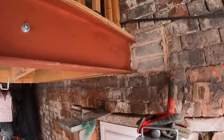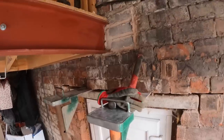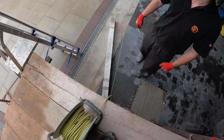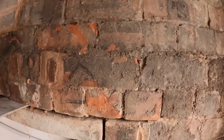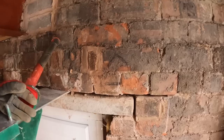So Robbie brought it to the attention of the customer, and they've said, would we come back and put a big boy in? A big bruiser in. So we've got a 1500 6x4. So we're doubling the thickness of the lintel, and we're doubling the seating. So it's going to have nearly 250 seating each side. So beefing it all up, basically.